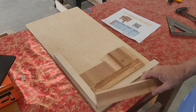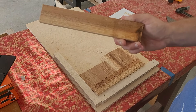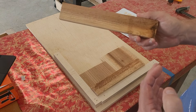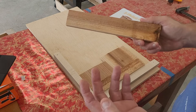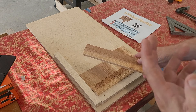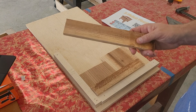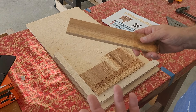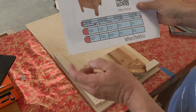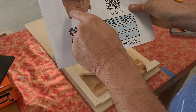For tip number four, I recommend using off cuts from a fence picket as shelf brackets for the shelf pieces. I recommend buying a couple of extra fence pickets and dedicating those as shelf brackets. I've had several customers ask me how much weight they can place inside the planter box, so just to be on the safe side, I install a couple of shelf brackets along the bottom of the planter box to make it more sturdy. You can do it on two sides or all four sides — that's entirely up to you.